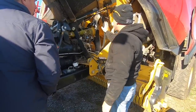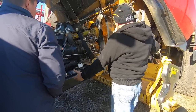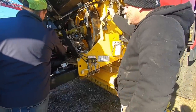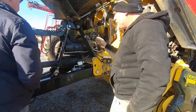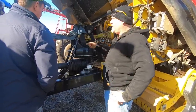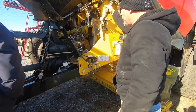But what they've done is make this flywheel a lot wider, bigger, taller, or whatever you want to call it, so the inertia is out farther. Maybe they don't need to have this. We have all the power coming in here, and we've got the secondary going up here to run it. It takes more power. There are two speeds in here, so you come up, and then it's got to go there. There's a lot of power lost here, and more power lost over that change, and then more power lost before you get into the main gearbox.